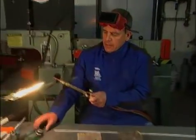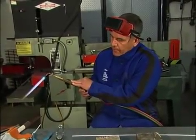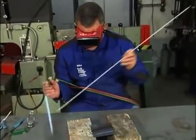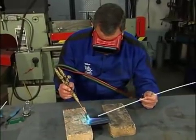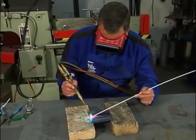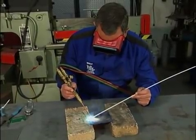I'm going to adjust and light my torch for brazing. When the metal reaches temperature, I'll add the brazing filler material — the brass — onto it. It's getting up to proper temperature now, and I'm going to add the brazing material. If it's too hot, it will flow too much; if it's not hot enough, it won't flow at all. So you have to maintain that proper temperature all the way down the bead.